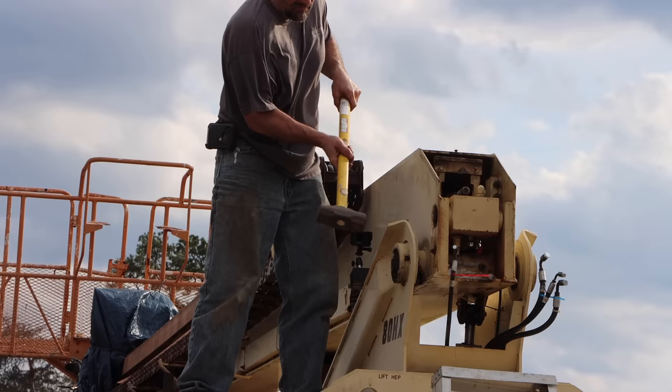All right, I have drilled down to about there. I think I have a plan that hopefully is going to help me here. I am going to heat this. I'm just going to use propane to get it warm, 400 degrees or so, maybe not even that much. I'm not going to try to get it smoking hot because I don't want to damage these things. And then I'm going to take some canned air, invert it, and spray the liquid into the hole to cool the pin. So hopefully I'm going to do the reverse of a shrink fit and get this thing to move.